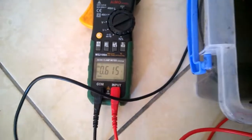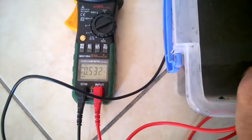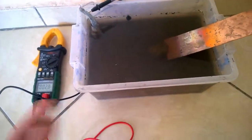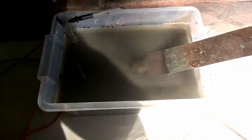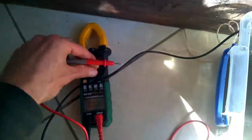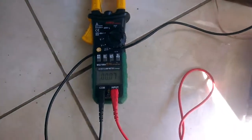So it hasn't made any difference to the available voltage, and coming just into the water: half a volt. So that hasn't actually changed my supply voltage. We'll put this back in the sun and let it warm up and see what that does. She's been sitting in the sun for an hour or two while I've been doing some eBay shopping, and we still have 0.6 volts and negligible or no amperage. So okay, that's not it.